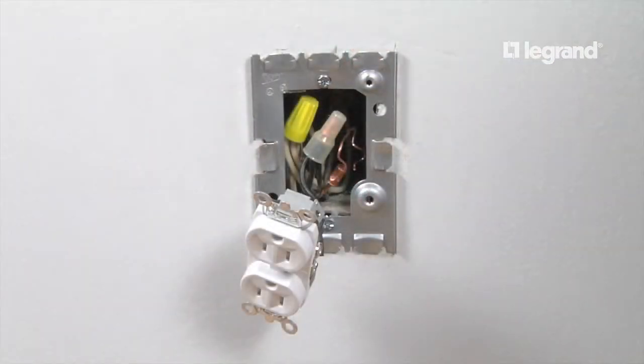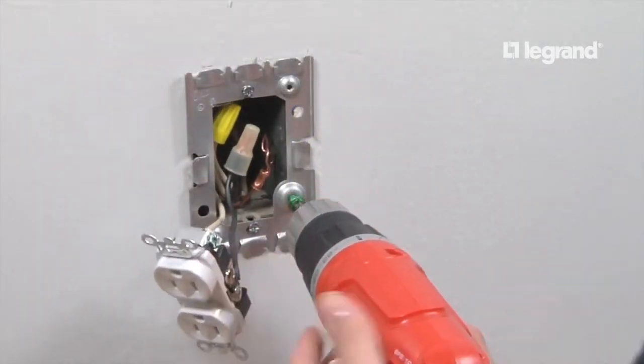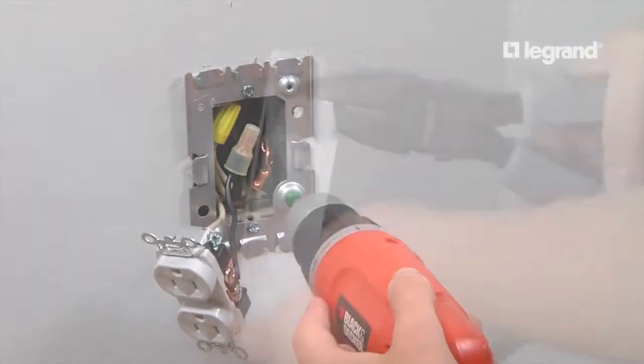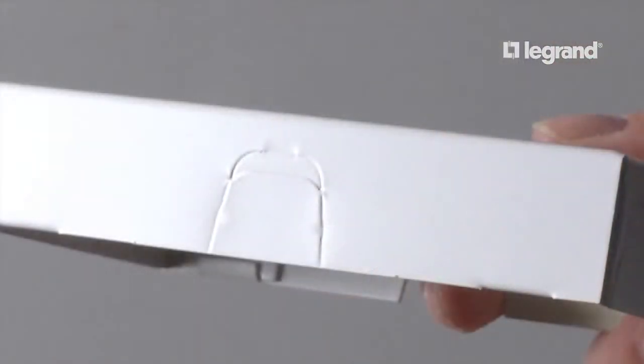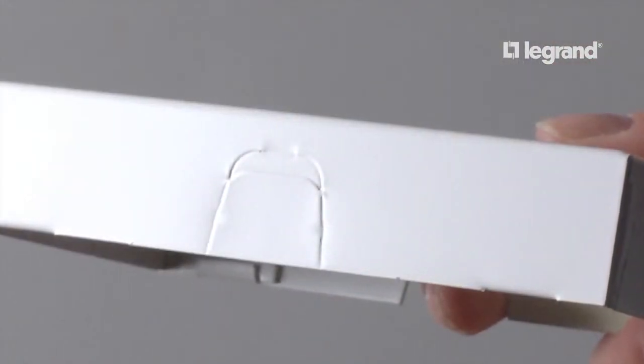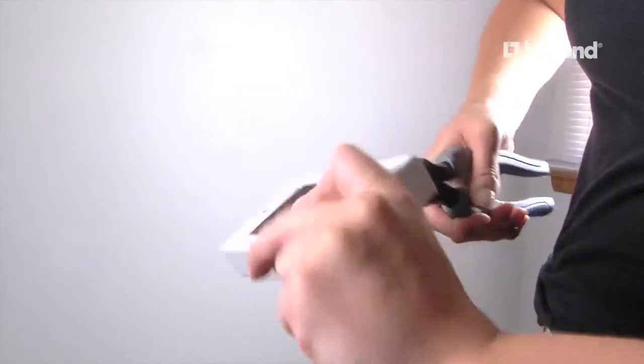These wires will be connected later to the new wires of the surface-mounted system. Install a number 10 ground screw into the threaded dimple on the starter box base. Next, break out the starter box twist outs. Note that the twist outs are scored for use with either standard ivory or high capacity white series. Make sure the knockout matches the Raceway profile used in the project.